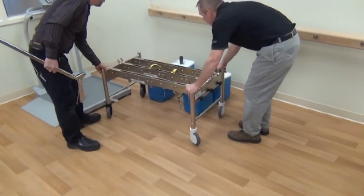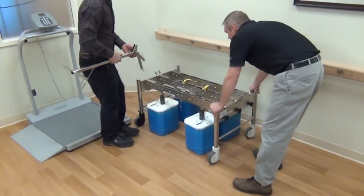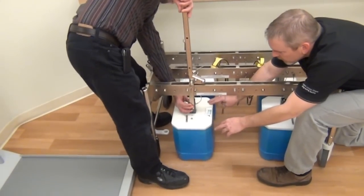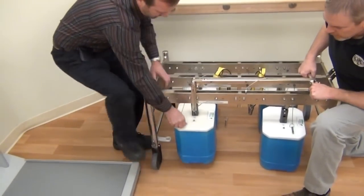The pumpkin weights are mounted to the lift load frame by using the lever handle. Two lever linkages are stored on the lever handle. By removing the pins, the lever linkages are freed from the sides of the handle and can be relocated to the fulcrum point at its base. The steel post of the pumpkin weights is then aligned with the load beam posts on the lift load.